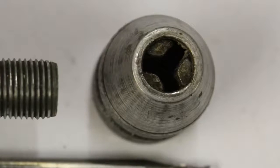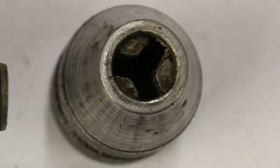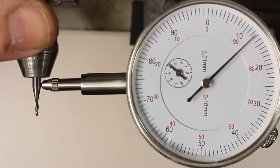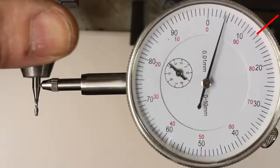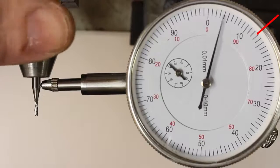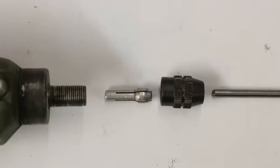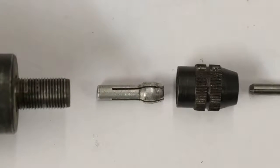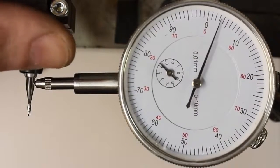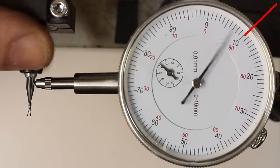There are two ways of mounting the milling cutter on the 100W motor. With a self-centering 3-jaw chuck, you can mount tools with a shaft diameter from 0.5 to 3.2mm — the error we get is almost 130 micrometers. The second way is using an aluminum collet; with that, the inaccuracy is just 100 micrometers.